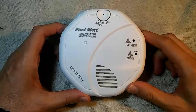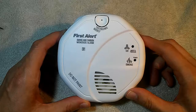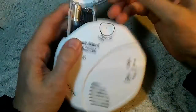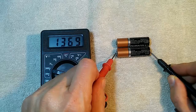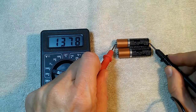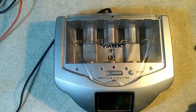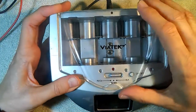After the second recharge, our smoke alarm is now chirping after just 61 days — about half the length of time after the first recharge. We are now down to 1.37 and 1.37 volts, and this battery here has got some leakage going on. Just out of interest, I'm going to try a third recharge and see if this trend of shortening time continues.